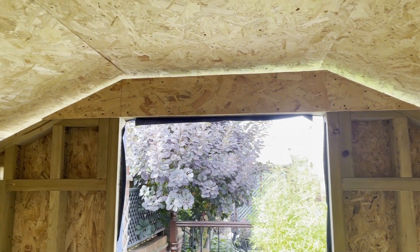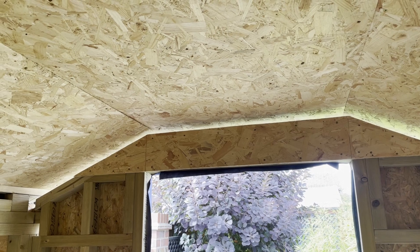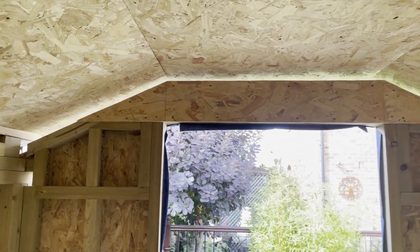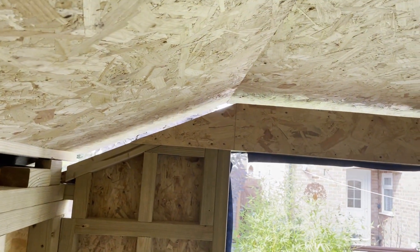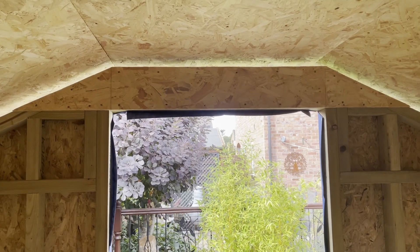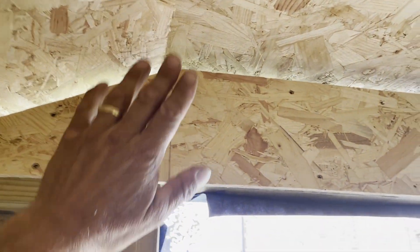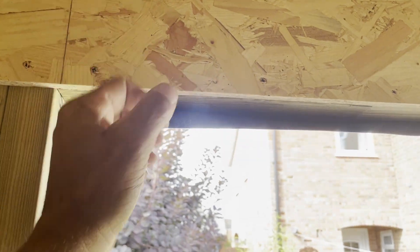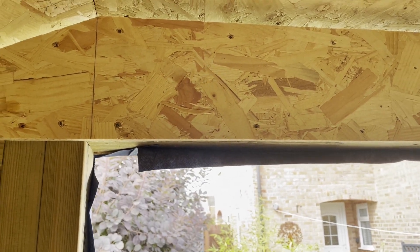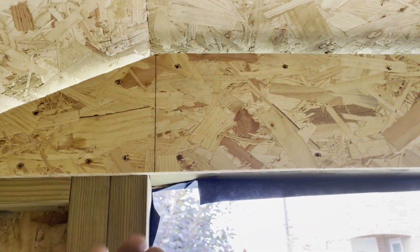I've managed to get the shape of the roof — it's not complete yet, I've still got to board it on the other side, insulate it, and then board it on top of the rafters. But I've managed to build the wall up to the underside of the roof with the correct shape and size. I've left that gap there so the roof will slide over the top, and I'll be filling that with a rubber seal. The area above the door is where my motor is going to go. I'm having a metal plate made up — a plate on this side and a plate on the other side, bolted straight through with four bolts going into the building. This is how I'll fix the motor so that if I ever need to remove it for maintenance I can just undo the four nuts and take it off.